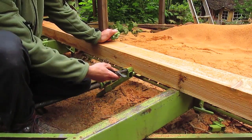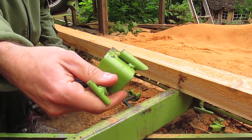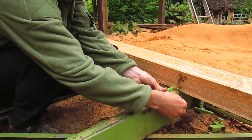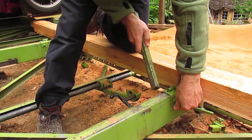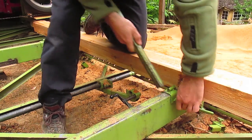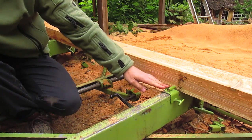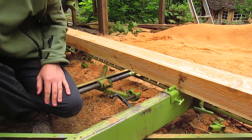When I get down to the lower sections of the board, I use these low-profile stops I made. They go right on here, tap them in place, and then lock them down. You can come right over it with the blade — I think they sit up about half inch to three-quarters of an inch — but you can come right over with the blade and have clearance.